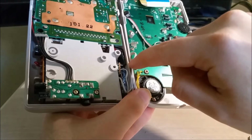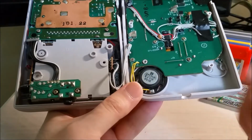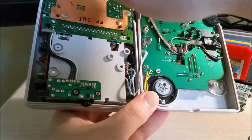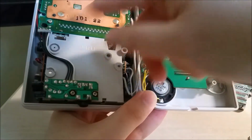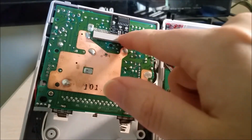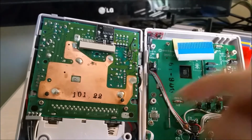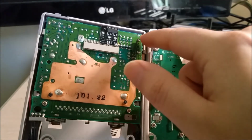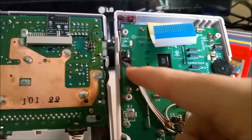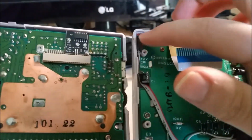And you can see it's very neatly wired, with sockets for everything to make everything easily removable and serviceable. So yeah, we can see the leads, red and black wire, and probably leads to one of the power rails on the main board here. And we have our Bivert hex module. It just makes the contrast absolutely insane. And you can see very neat soldering just to ground to that point. And here we have some more IDE wire going up to the touch sensor, which is very nicely hot glued in there with a socket.